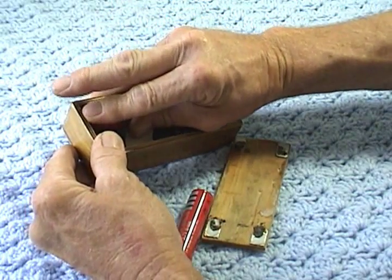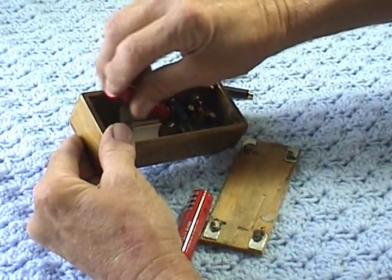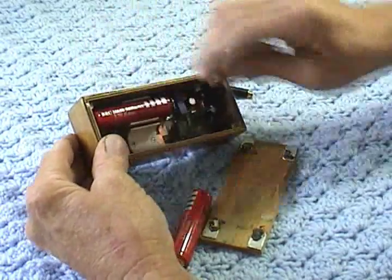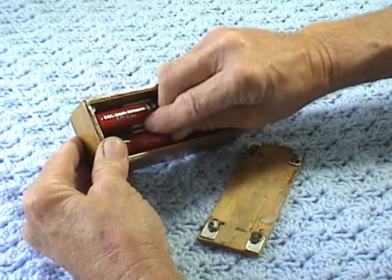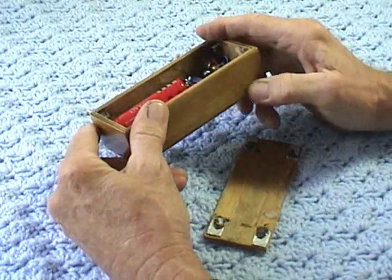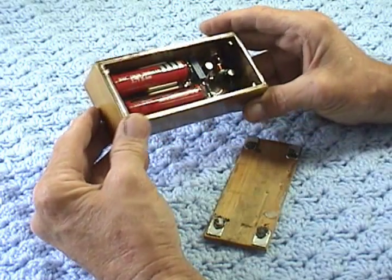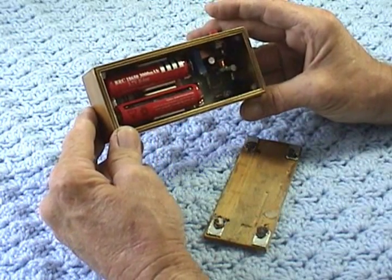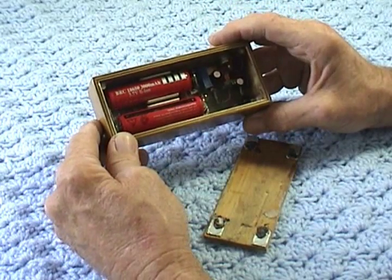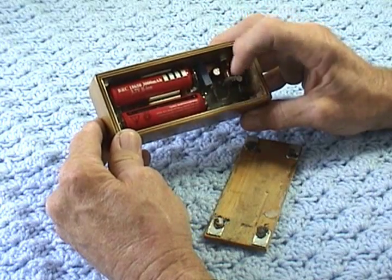At any rate, I have this working model. I've got my spring around there. The battery holder worked much better before I put it in the box, of course. But you push the button and the LED lights. I considered putting a hole in the box but it was an afterthought — I'll let my son do that if he chooses. I used a 1K pot, 10-turn, with a resistor in parallel to give me my limit on the adjustment of the pot and a series resistor.